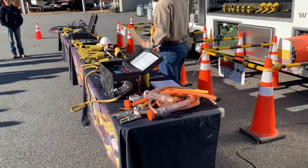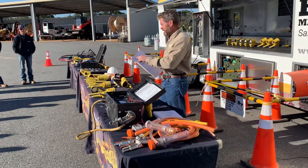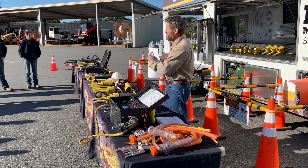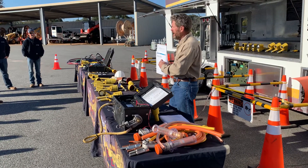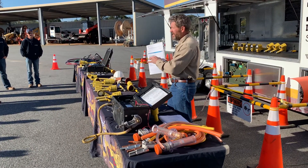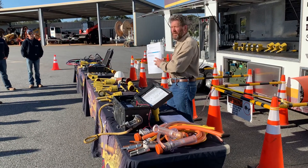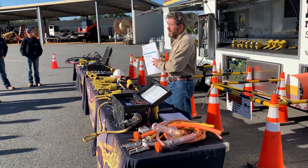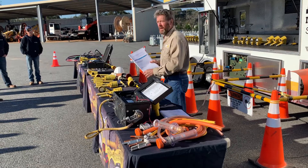On the personal grounds, OSHA requires in their regulations that you also use the F855-20, which just came out, and you also use the IEEE-1048. I recommend for any of you that are in safety that you get these to have in your hand and read them. I also recommend that linemen read these from time to time.